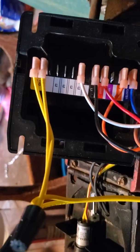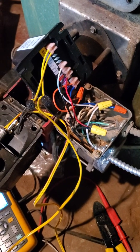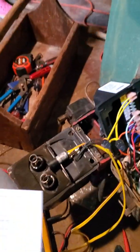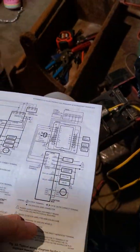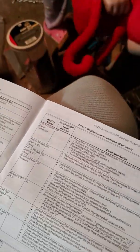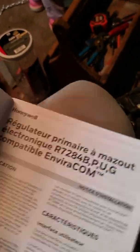The end of what I'm going to do - this was plug and play so far - but I'm going to go back through the software. I want to make sure my lockout is up to 45 seconds. Looking at our manual here, it does say somewhere in the service that if you hold the I button, I believe it should get you out of your service lockout. So hopefully for anybody watching the video, that should help you out once you get into your service lockout. These things need to be held down for 10 seconds - that'll get you out.